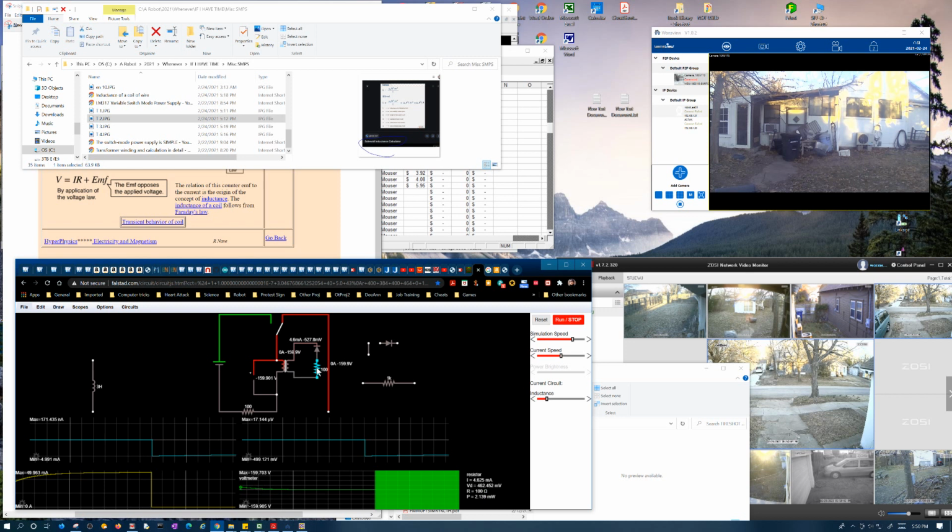So we've got a 100 ohm resistor here with half an amp going through it. I'd expect to see 50 volts on the output, not half a volt. But I'd also expect to see half an amp over here, not 5 milliamps. This seems to be doing just the opposite, reducing the voltage and the current, and that just doesn't make sense.